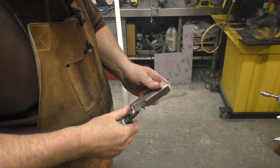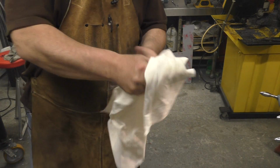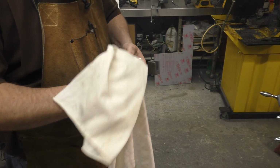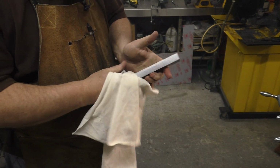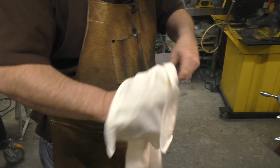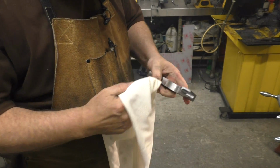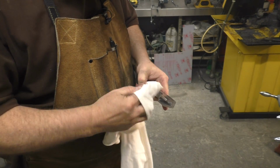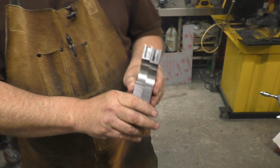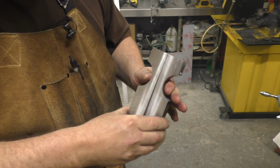And do one of those. And do one of these here. There we go. So, clean this up a little bit. That fly cutter, or that not fly cutter, the shell mill, worked pretty good. I didn't really want to use it that way. I would normally use a boring bar, but a few episodes back when I was doing the tooling for the welding table, I had to make some Acme cutters, so I ended up using my boring bars and chewing them all up. So anyways, there we go, guys. Got the contours on both sides, and they look pretty good.